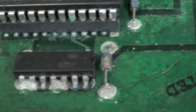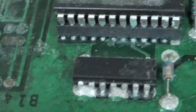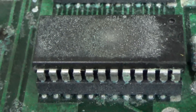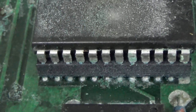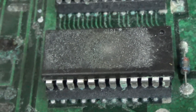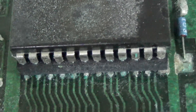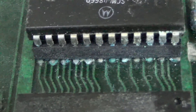We're going to clean this up with sandpaper and go crazy on it. This chip here is just a logic chip, and you've got some bypass capacitors here. Now the EPROMs — we're going to replace all of them. These are very small chips, so over time they came up with a way to consolidate some of them so you don't need as many. We're probably going to do that, which will limit the number of sockets we have to repopulate on the board. This one isn't that bad either — obviously they need replaced, but it's not the end of the world.